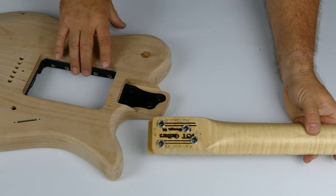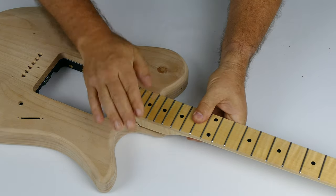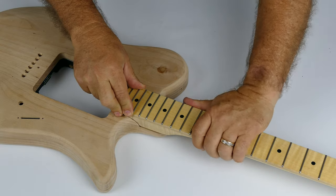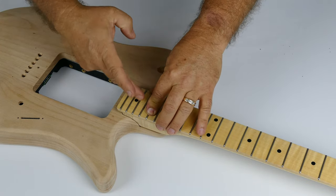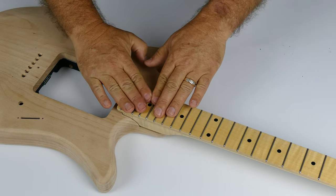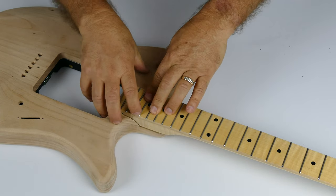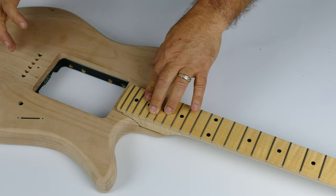These sleeves are designed to fit right down inside these four counterbores, so we will fit this in and press it in — we might have to massage it a little to be snug. Here's the reason why this makes it so solid: there's no rotation. I can't pull or twist on this anymore, it can't shift out of place. It's rock solid center, because we've machined this to be dead center on the pocket, so you always have your strings even. And once it's bolted together, you're not going to get any variation in pitch, because we've torqued down all four machine screws. Now the neck has become part of the aluminum, the wood, all sandwiched together and locked together as one solid structure.